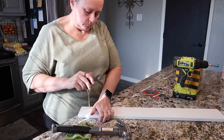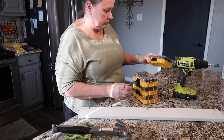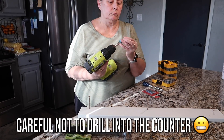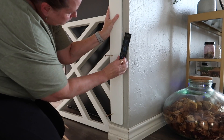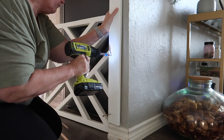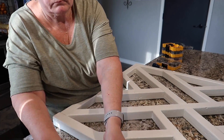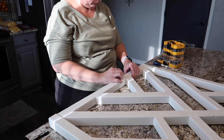I'm using a hole punch here to mark where I want the screws to go in — it sort of holds them in place as I'm screwing into the wall so I can do this by myself. Now, the next part I absolutely do not recommend doing on your granite counter. I did not drill into my counter — let's be clear — but it was stupid to do that, so don't even do that. This is the board I pre-cut to the exact height of the gate, and I'm using my level to get it at least somewhat straight when screwed into the wall. My thinking is if this is attached securely to the wall, I can securely attach the gate to it — because it's wood and not drywall, it'll be more secure for people pushing to open and close the gate, or a toddler that might try to hang on it.